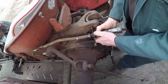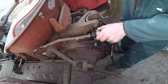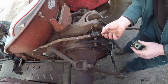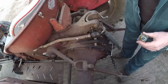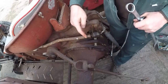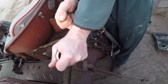First thing, we'll just take off the adapter — and we can. So hopefully this can now go and live on the 550. And here you can hopefully see the problem: in there is where the rubber seal should be, and without it, when you lift anything up on the linkage it leaks. So that's where it's got to go. It's held on by a little bracket, held on by a half-nut backing it up, and that is to fit in for the oil pipe. So let's hope it comes undone and nothing breaks.